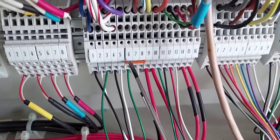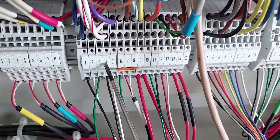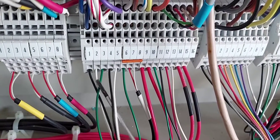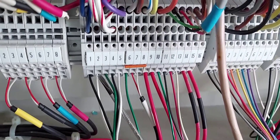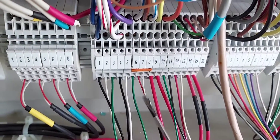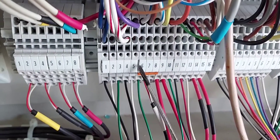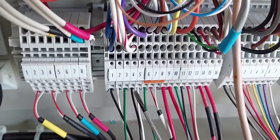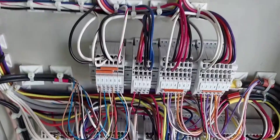This one is terminated right here between terminals four, five, and six — three wires. Typically your pressure transducer will have three wires: two of them are power, usually five volts DC, and the third wire is going to be your signal out.